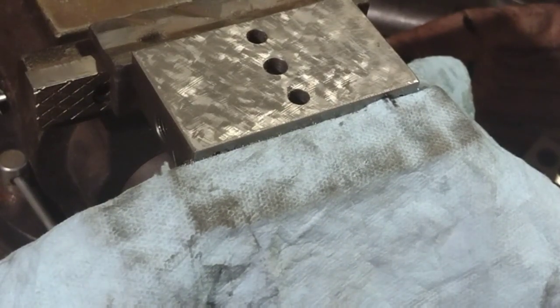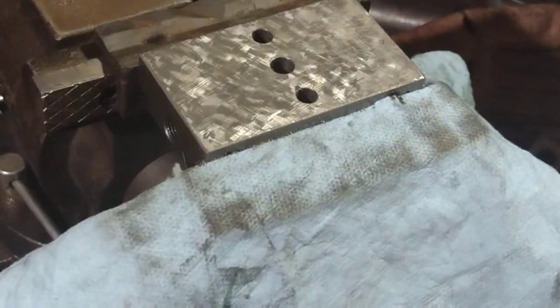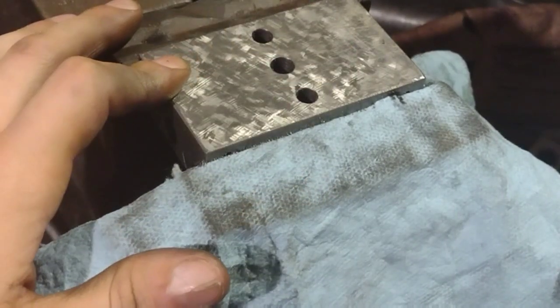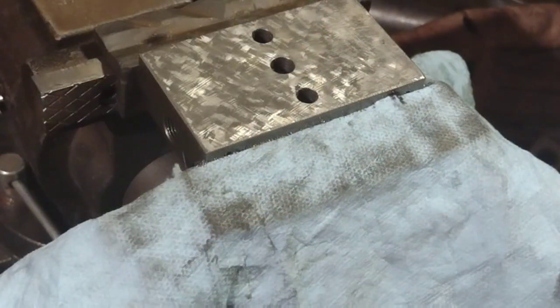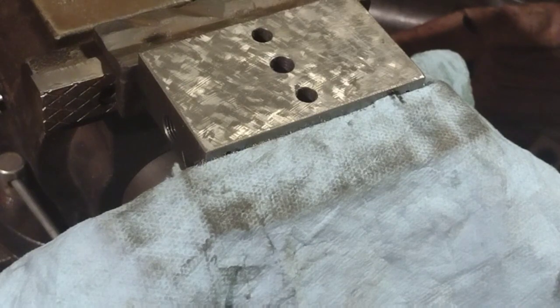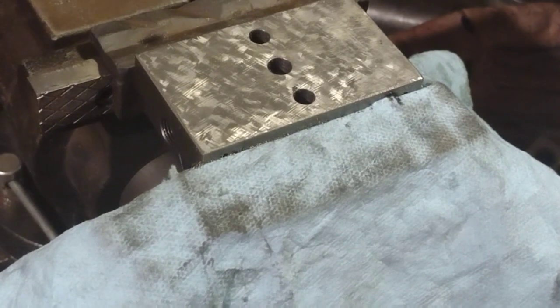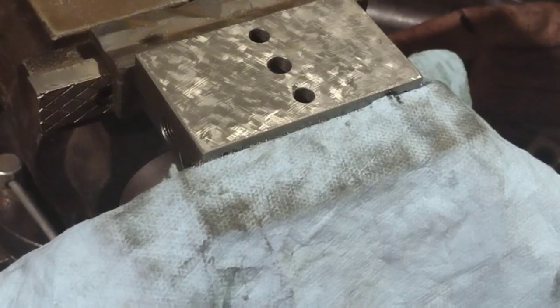I guess this is kind of a weird way to go about taking out a little bit of tilt in a part. Scraping is for flatness. But I don't know. I want to get some practice. And this is the bottom part. No one's going to be looking at this, so if it looks bad, which it kind of does, I'm getting my practice rounds in. But yeah, we'll do some rock tests. I don't quite have any Dykem on the surface plate right now, but once we get to that point, we'll start actually looking for flatness in a more legitimate way.